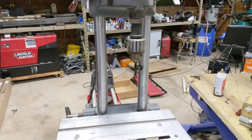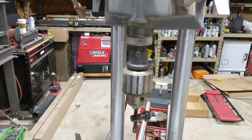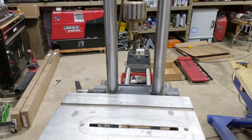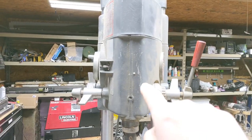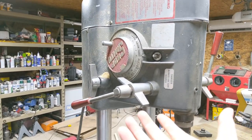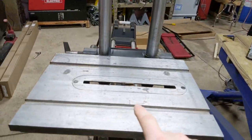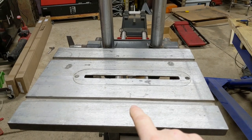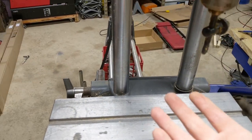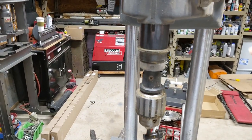Here's why: it only has a little over four inches of throw, and that's fine, but what that means is when you have things of different heights you're either going to need to block it, raise the table, or lower the head. The head weighs a ton and it's really difficult to lower — you have to loosen it up and manhandle it down and tighten it back up. It's just heavy and awkward. The table is also heavy and it's kind of the same thing — you loosen it up, it's going to fall on you if you don't hold it, you lift it to where you need it and tighten it up, and hopefully you get it right because you only have four inches of throw to work with.